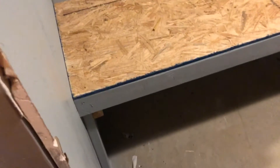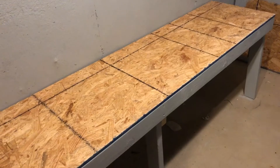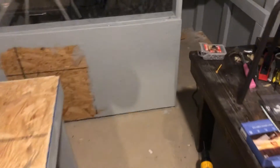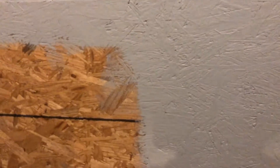I'm starting to get the other bench done with some untreated two-by-fours and a piece of OSB I cut. You can see over here — it's really cool how paint just changes so much, not only what it looks like but also the longevity. I think OSB lasts a really long time. My workbench out in my garage has been there about two and a half years and I put a nice thick coat of paint on there — actually I think I put two coats. Once you get two coats, it just keeps the dust and everything out of it. I'll do the same here. I went ahead and screwed this board into the end here and I got braces under there just to help hold the legs together.